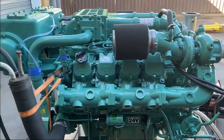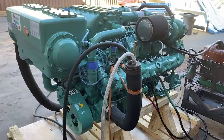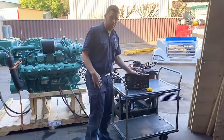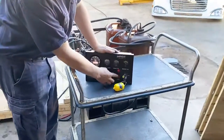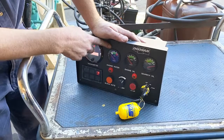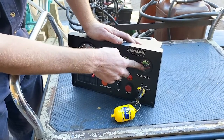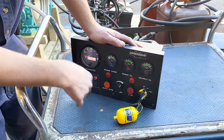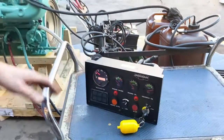That is about all I have to show you around the Doosan V158, because they are a simple engine. Next we'll crank her up and let you have a listen. The starting procedure is very simple with the analogue panel — simply a case of turning the key. Always recommend pushing the stopper; you can hear the mechanical stopper engaging. Our gauges show a tacho, engine water temperature, engine oil pressure, and gearbox oil pressure. Note the gearbox oil pressure is pegged over since we currently don't have a gearbox connected. Then to start, it's just a turn of the key.